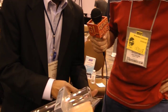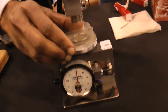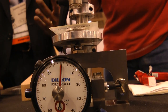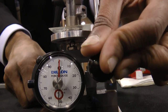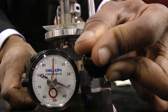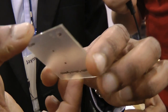Just to show you how much retained strength the glass still has, we'll take this piece of glass and put it into this lever press — an industry standard test used to measure the surface strength of the glass. Remember, we've actually bounced this 130 gram ball off that piece of glass twice. We'll now apply a load to the glass. This gauge is telling you how much load I'm applying — I can go up to about 100 pounds. And the glass is still intact. Very nice. I don't know how many of my friends' phones I've seen with cracked screens like this — obviously they don't have this product in their phone.